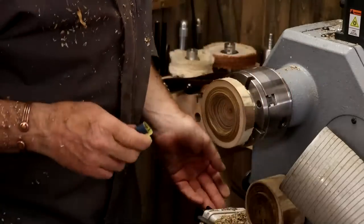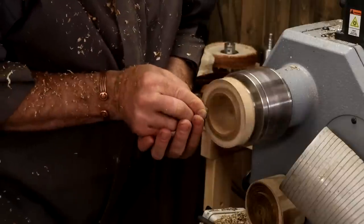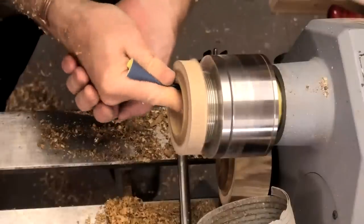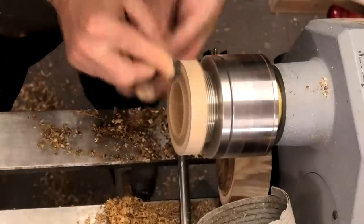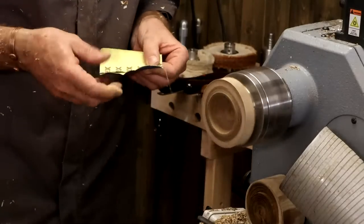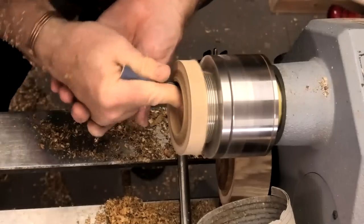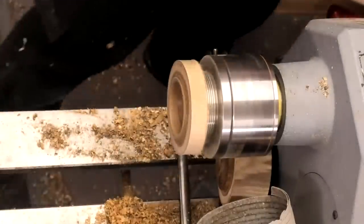Knock the dust out a bit. Lower speed stops you cooking those resins on, allows it to clear. Fingertips again — how's that flow? It's nice. Let's do that little hollow curve out here — the 150 is going to do all the hard work. Go to 240, doing lots of support with the left hand hoping to support that while we sand. Too cool — let's have a quick look, check we haven't missed anything. 400 when you want one — fold it into three, on your fingertips.